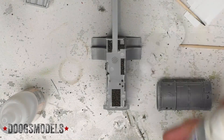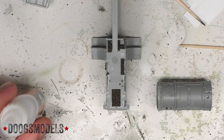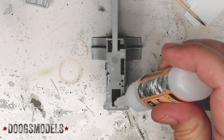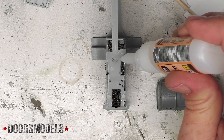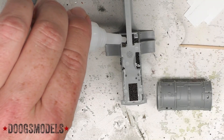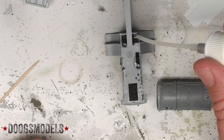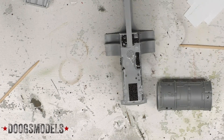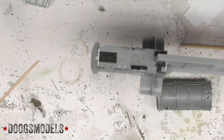So I've added the liquid gravity — which is basically just a bunch of little metal balls — to the various depressions on the top of the nose gear bay. Now I'm going to take some VMS Flexi CA, which is one of the thinner CAs I've got, and add accelerator to lock it in. And we have ourselves a slightly weightier nose area. Fantastic.